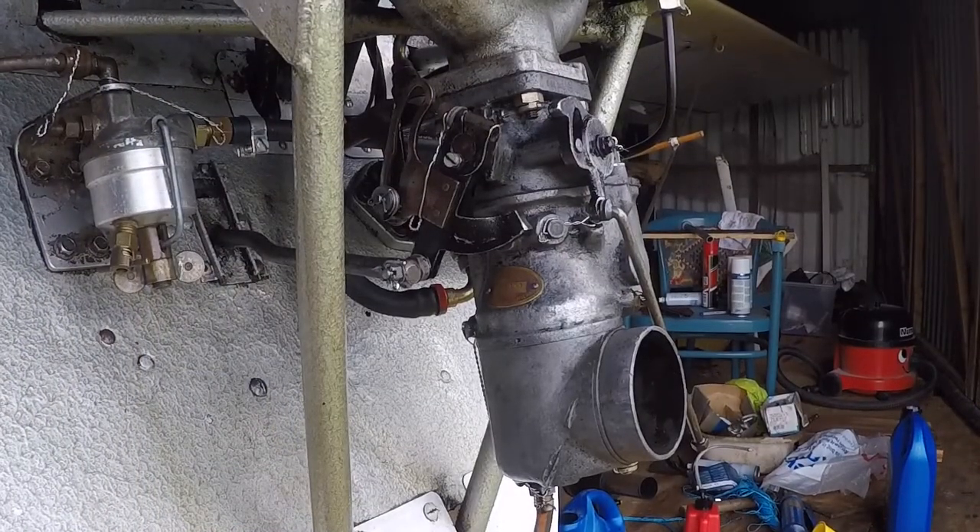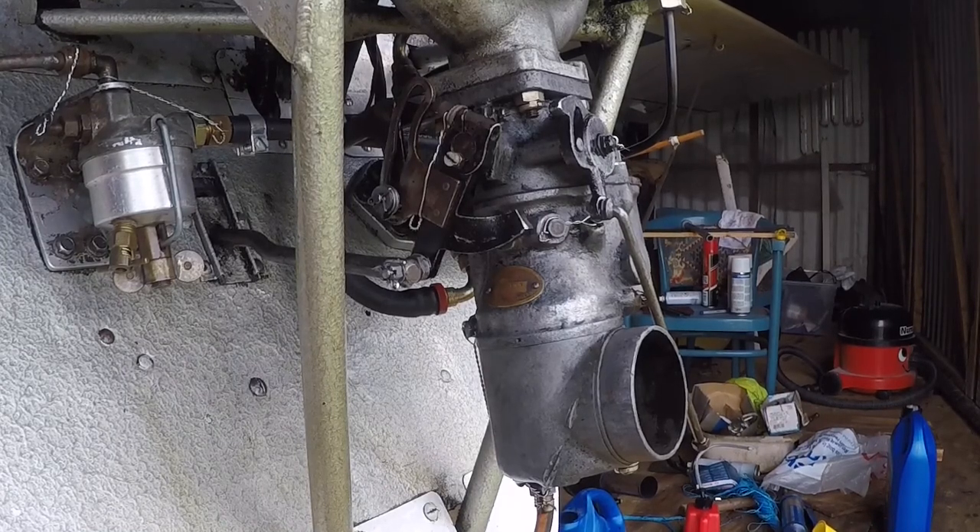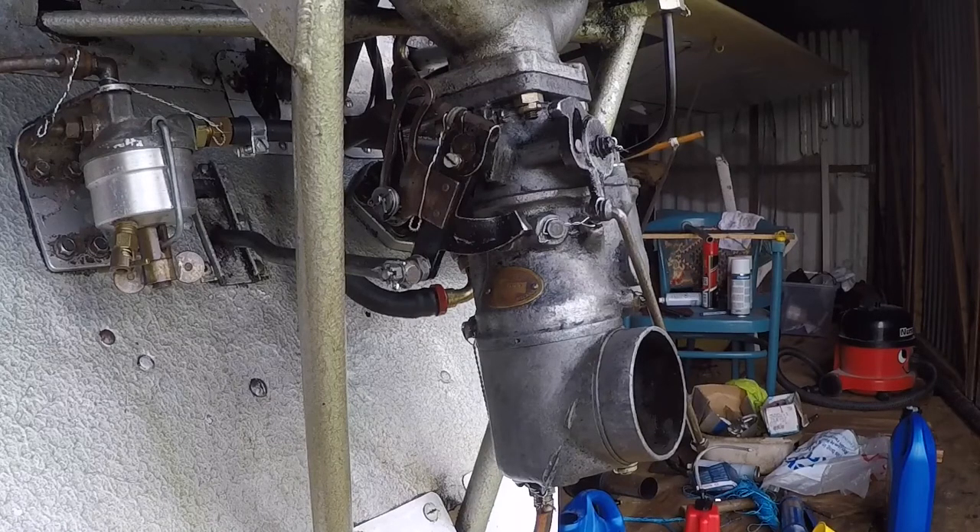This is the carburettor — it's an Amal carburettor, made by Amal of Birmingham. It's a 189-100; they only made a few of them just for these engines, so they probably only built about 100 or so. I've got several floating around. They were particular to these JAP engines. The Aeronca generally had a Stromberg NAS2, which I do have — it's going on my Prager engine. It weighs a little more than this. I tried it some years ago; it did give about 20 RPM more, but it wasn't really worth messing around with.